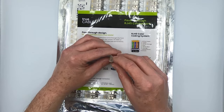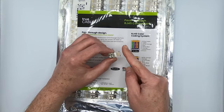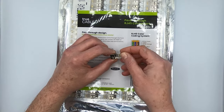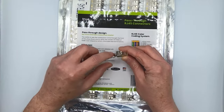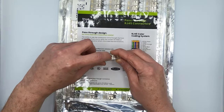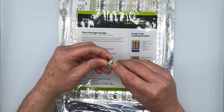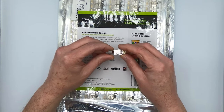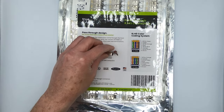This is a staggered plug — it does stagger the conductors. It is also pass-through, so the wires do pass through the front of it and then get shaved off with our crimper. And even though there's not a strain latch in the plug — that being a piece of plastic in here — there is a provision so that you don't have to disengage your strain latch presser bar on your True Crimp tool. And of course, there is also an external ground on there.